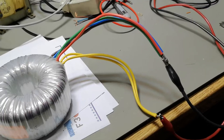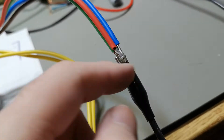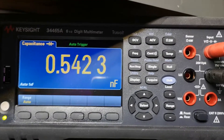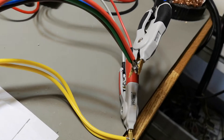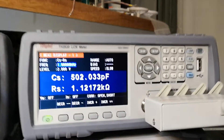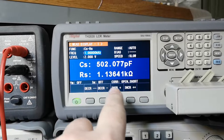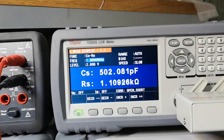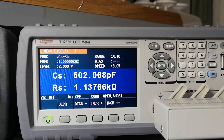The primary winding is 4 ohms. With power on it, the idle use is 1.7 watts for only one of them. Let's measure the capacitance between the primary and secondary windings. I've taken all the secondary windings and coupled them together, and the same for the primary windings. Using a four-point measurement method, we get about 500 picofarads. Across a broad range of test frequencies you get the same result — that's how this instrument works. So: 500 picofarads.